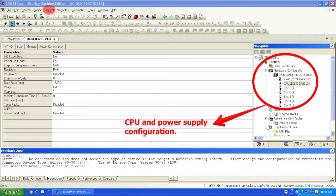Once that's cleared, I'm going to hit the Download and Start Active Target button — it's the icon to the far right that shows downloading information and a play/run button. The first window that pops open is going to ask you what exactly you want to download to the controller — just configuration and logic. You don't want to set any IO in motion or download any IO, and you don't want to put anything to permanent flash memory. This is just a test to turn the CPU to run mode and have it remain there. So I'm going to select OK to configuration and logic.